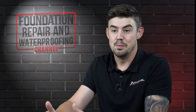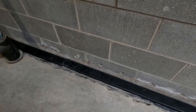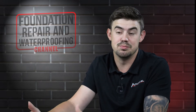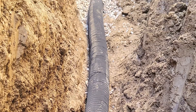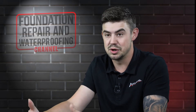Not necessarily every basement needs one, but you don't really know which basement does need it and which doesn't. So the safe thing is to have one to make sure it's done. Pretty much every home being built today has an exterior drainage system put into it — it's part of the inspections and part of the code of building your home, so it's there at some capacity.